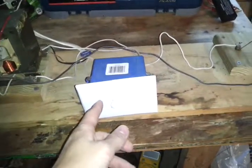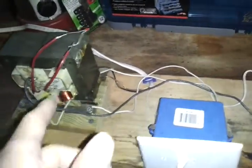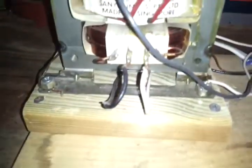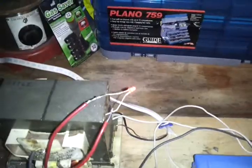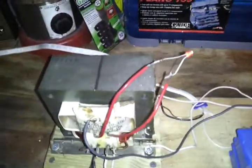I have it just on this switch here. The 120V comes in through the wall — one goes to here and one goes to the switch. When we turn it on, the 120V goes right here to the front. The first thing you notice is the LED turns on. This isn't a separate transformer or anything wired up — the LED is actually being powered off of this microwave oven transformer. There's just about three volts or so that come off of that, which is great for an indicator LED.